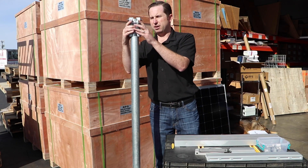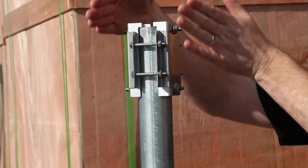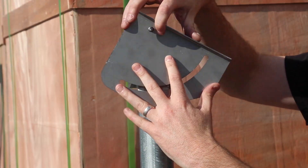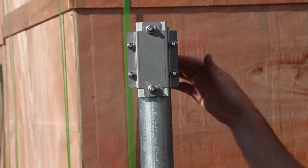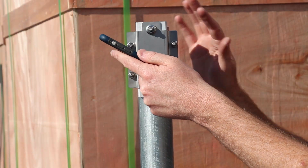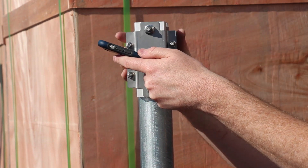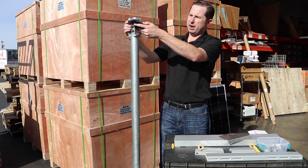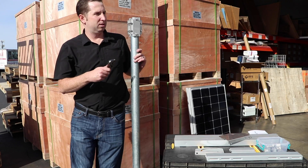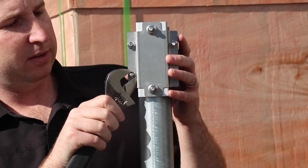That is looking pretty good. At this point we can decide where we want our solar panels lined up. It's going to tilt along these plates once we get the tilt brackets on. We want this point facing true south — we can use the compass app on our phone to line it up. It doesn't matter which side faces which direction, we just want to make sure one side faces true south. Once aligned to true south, we will tighten up these bolts using the crescent wrench, making sure they're all aligned and tightened well.